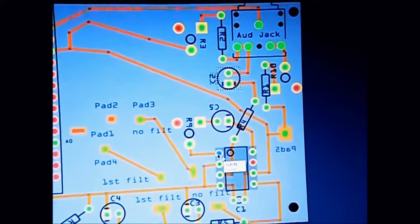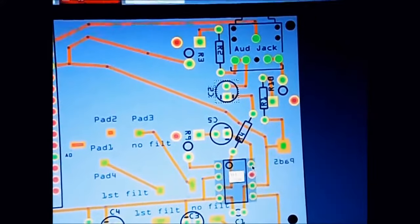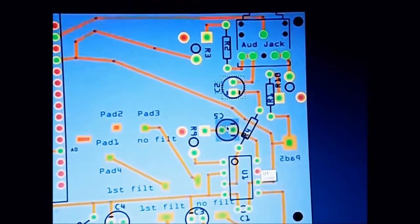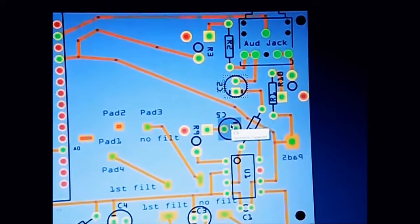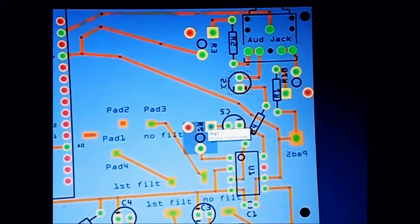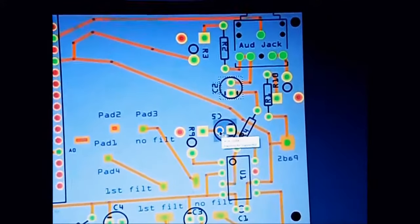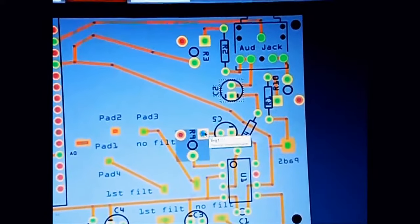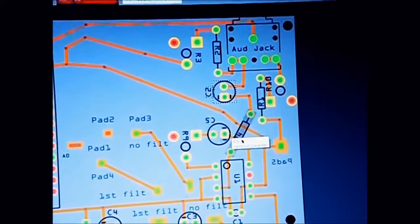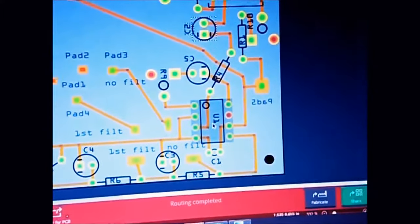On the LM we have one interesting thing to control the gain. If we take all this off and don't connect anything to pins number 1 and 8, we have a gain of 20. But if we connect only one capacitor of 10uF without this pot, we will get a gain of 200. And I put a 1k pot so I can actually fine tune it here. The capacitor's positive side has to definitely end up on pin number 1, and the negative side of your capacitor has to end up on pin number 8. So now when we have signal, we can move on to filtering.